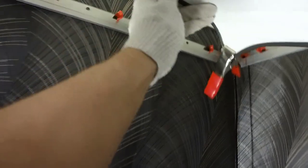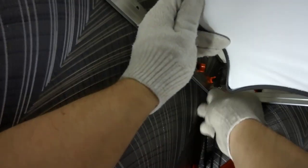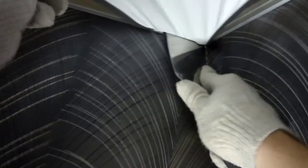We put the gas gun on the floor, climb the step ladder. Hold the canvas with one hand. Remove the clothes pin with the second. We take the trowel, insert it into the harpoon, bring it to the corner. Change the position of the trowel from horizontal to vertical and insert the canvas into the profile. One hand is released. With that hand we pull the canvas against the wall and fill the ceiling into the profile.